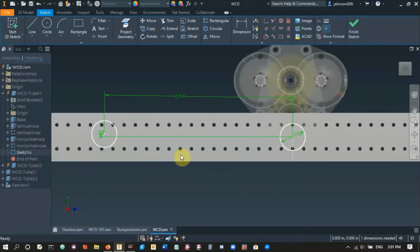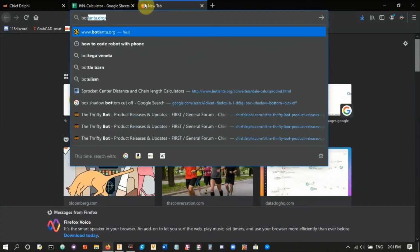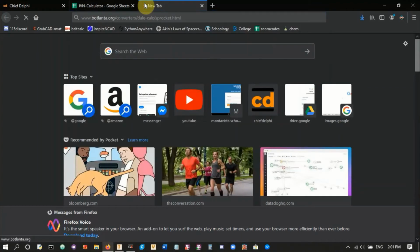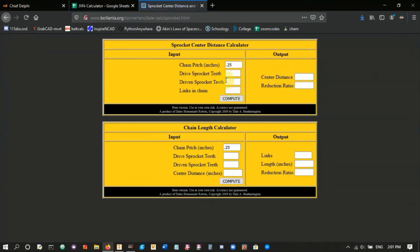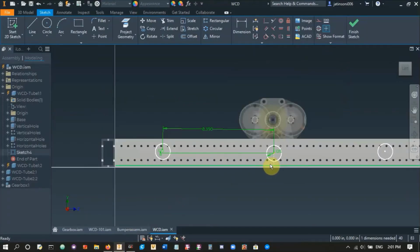So we have this, we need to change this distance, right? So this is where we go back to our bot lambda calculator. I'll put all these links to the JVN calculator and bot lambda in the description, but basically it's a chain calculator, and I think we went over this in CAD trainings, but I'll just reiterate it. Basically it's to find the distance between these two circles here, so that we can put a nice chain loop around it and not have to add any extra things to our chain to make it fit.